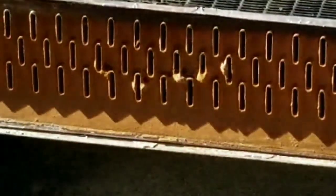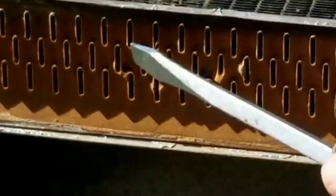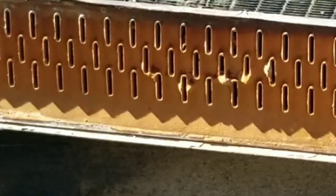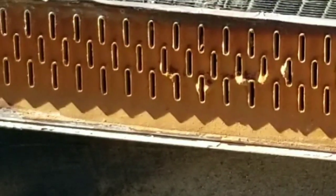Not making this up here. Okay. So these are large tubes. So we would actually want to block that tube. We would want that cleaned out so we would get a full fill, so it's mechanically bonded to the brass, and get a full fill.